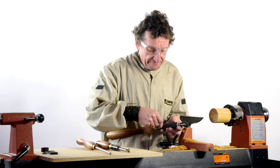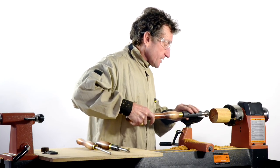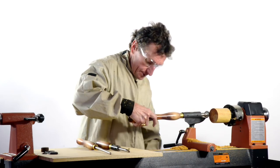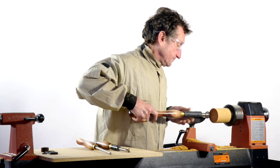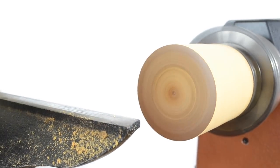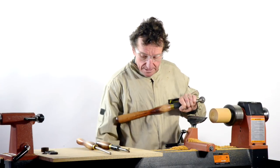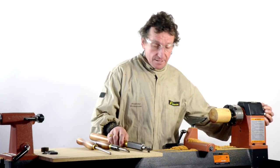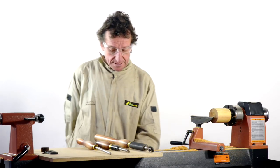Now let's loosen the sleeve and use the wheel vertically — in theory this should give me a stippled effect. I'll bring the tool rest in closer, make sure I have plenty of clearance for the wheel, and start the lathe. I've simply just gone left to right, right to left, left to right. And there we have our stippled effect, which I can now highlight just with a pencil tool to see just how that shows up.